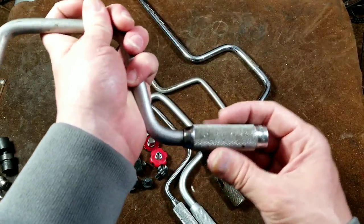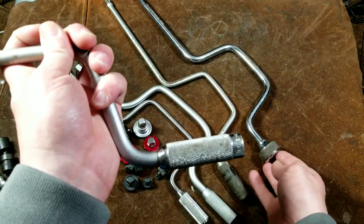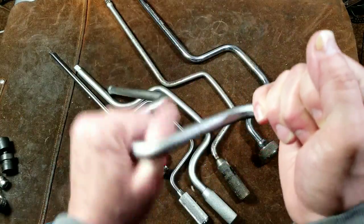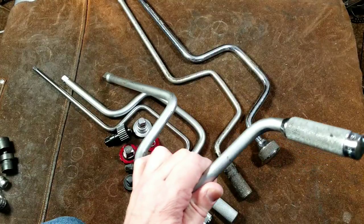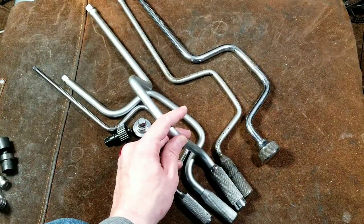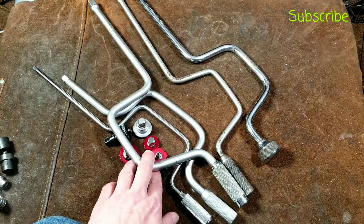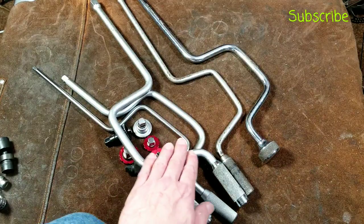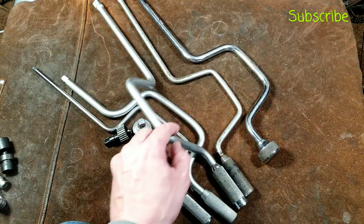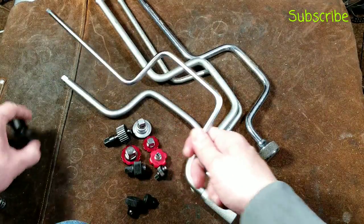Handle styles vary — the SKS models use straight round handles, similar to this Harbor Freight and Craftsman, but I do like the wider handle on the Proto. As a demonstration, you'd grab it with a socket on it and hand crank them off — you can go pretty fast. They're still handy for assembly work, and because of the long stem you usually don't need extensions. They can also be more ergonomic since you're not as close to the fastener. I recommend swivel sockets — specifically impact-style swivels rather than a standard universal joint.